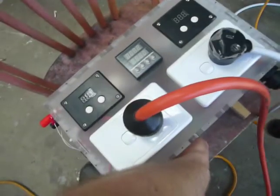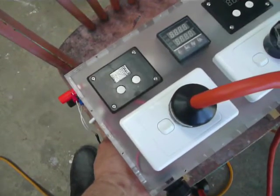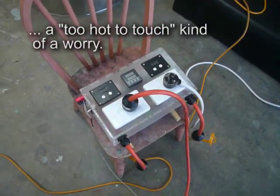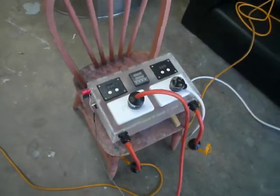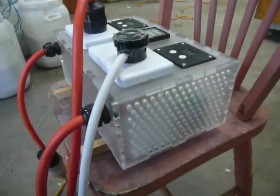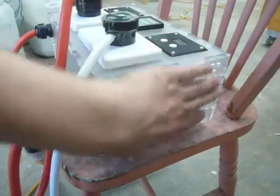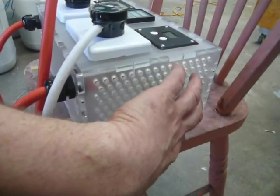They start cooling off quite remarkably fast once the power goes off. The heat in the back of that was starting to become a worry for me. I could start getting a bit of an electronic smell there, which means it's getting too toasty. So what I'm going to do is find myself a little transformer and a 120mm computer fan, take this panel out, throw it back into the laser cutter and chop out an area for a fan to fit and screw into.